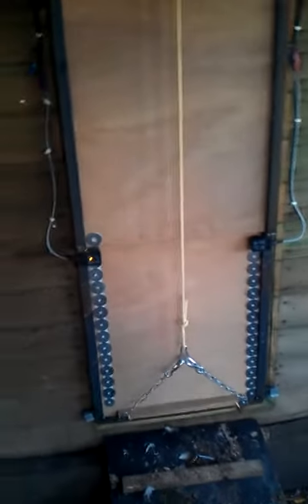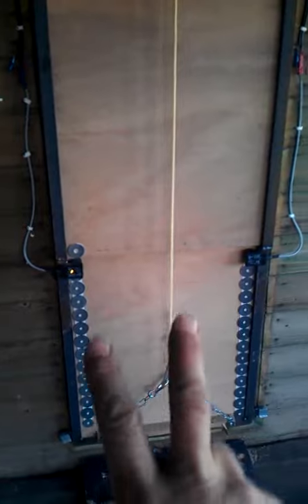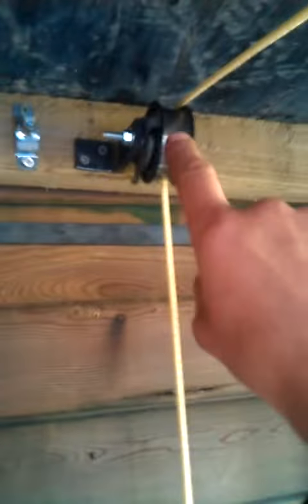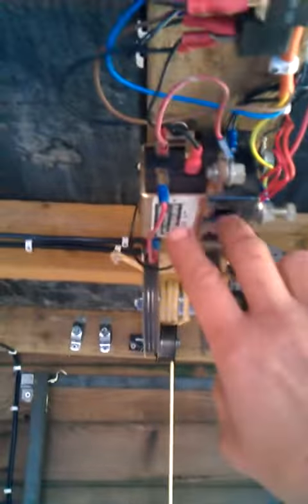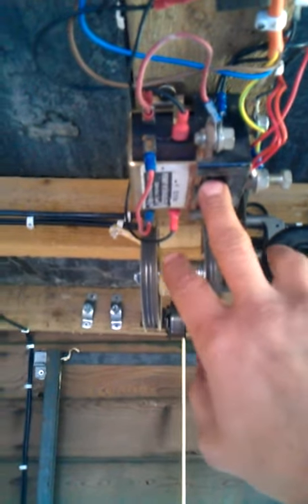Here's my 12 volt electronically operated chicken coop door. I used a battery, a couple of proximity sensors — one which will sense up, one which will sense all the way down — a starter cord, recoil cord, an old cam belt tensioner, an old windscreen wiper motor, a changeover relay from a winch just to swap the polarity over on the motor to make it go up and down, a couple of normal four pin relays, and a couple of guides just to hold the rope into place.